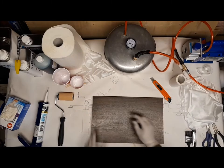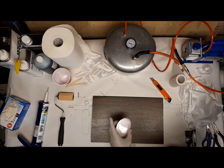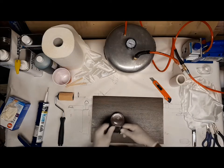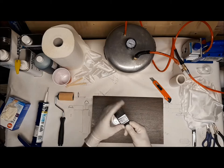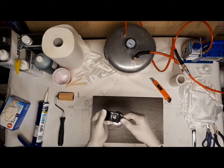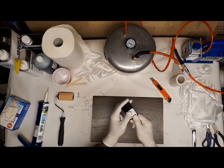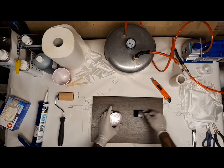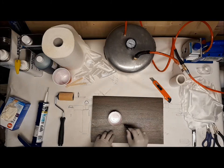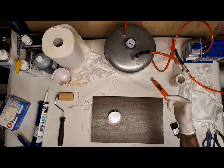Let's mix up some resin, and while doing that I can pre-pump the vacuum. About the brushes — sometimes I use a roller but most of the time it's a dollar store brush, one buck for five brushes. I chopped half an inch off to make them stiffer, because when applying resin a stiffer brush taps it in and releases the air better.